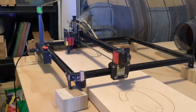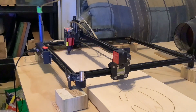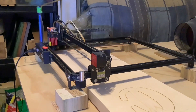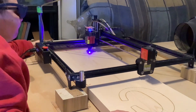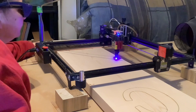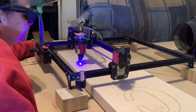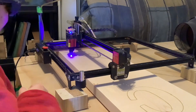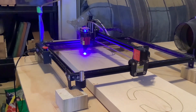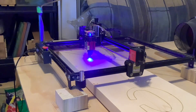So here I am just setting up my laser. I have jogged the laser and I'm setting the origin right now. So I focus it, because I have measured and made my pencil markings of where I want this lettering to go. And there I am homing it and framing it. This way I am able to move my sign around and get it within the lines that I have put down with my pencil. Sometimes it's a little tricky or a little crooked, so that's why I make a horizontal and vertical box to make sure I get it right in there perfect. I did four passes — I probably could have done more, but I'm actually pretty happy with the four passes.